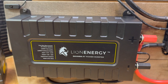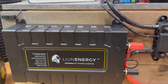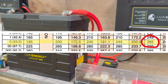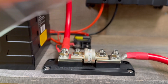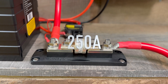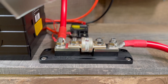In this system, the inverter is going to place the highest demand — potentially reaching maybe 250 amps on the high side. This is 1-0 cable that is capable of carrying 285 amps continuous, and that is connected to a class T fuse. So from the battery to the class T fuse — should there be a short, this fuse will blow, preventing any more current from flowing from the battery and potentially causing damage or a fire.